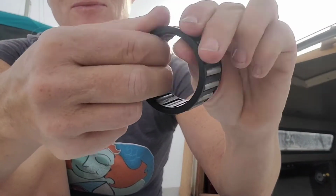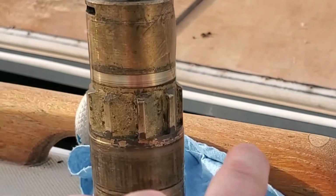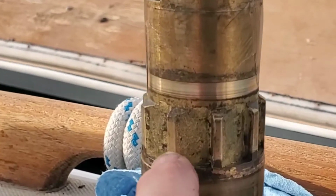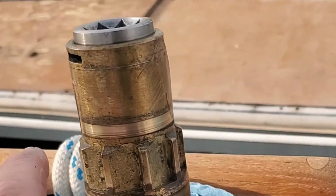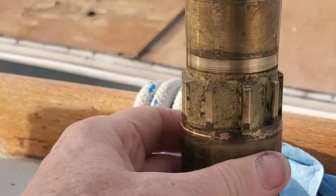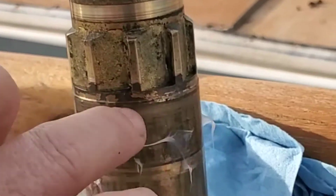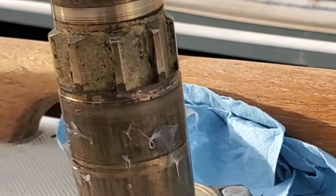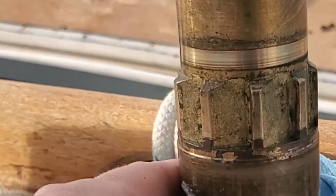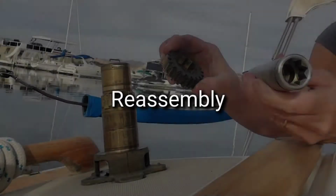The key is just that you don't want it gunking up again and drying out. I'm going to avoid this area because that's where the pawls will be hitting. But anywhere on the shaft that the pawls aren't, I will be greasing. So here we go with some super lube. Not too much again, because I've already done the bearing rings. Putting this thing back together.